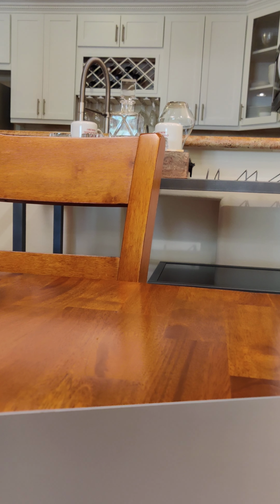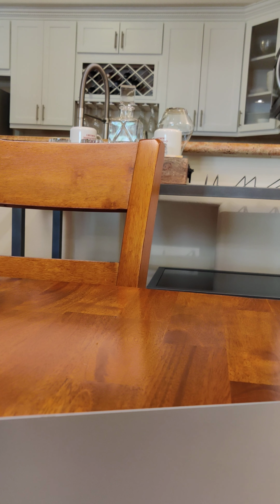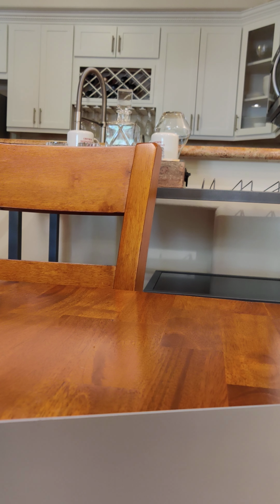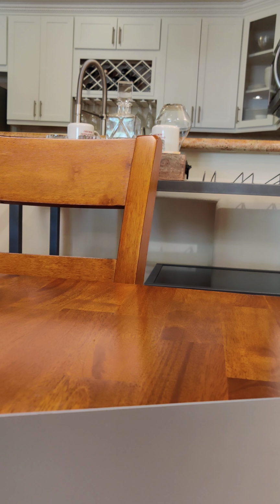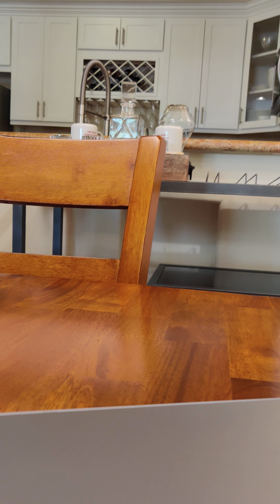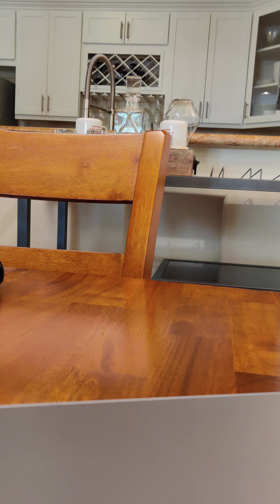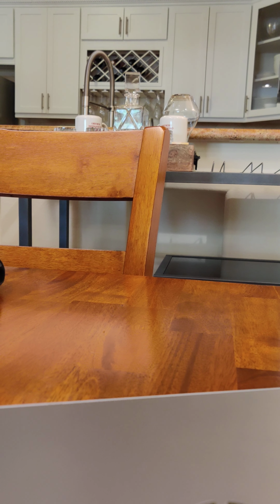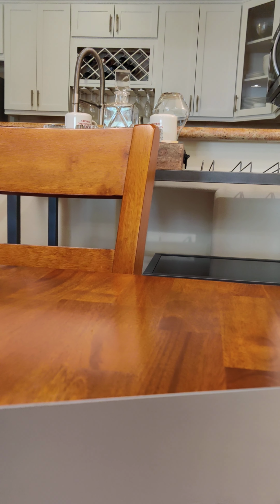And then also in that bathroom, I just noted that the shower enclosure door, down on the left side, you can tell there's some corrosion, and you can kind of see where it's maybe leaked down the wall and got a little bit of tiny water damage. It's minuscule, but I do note it. Maybe it needs some caulking. It probably just needs a little bit more clear caulk sealant around the enclosure.